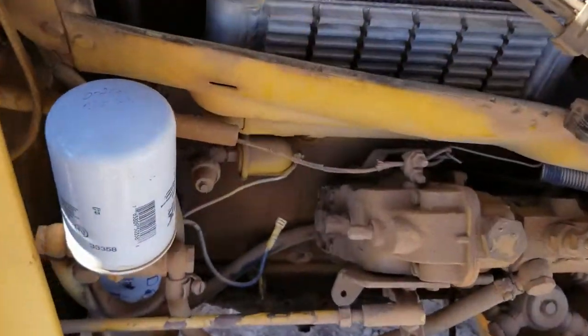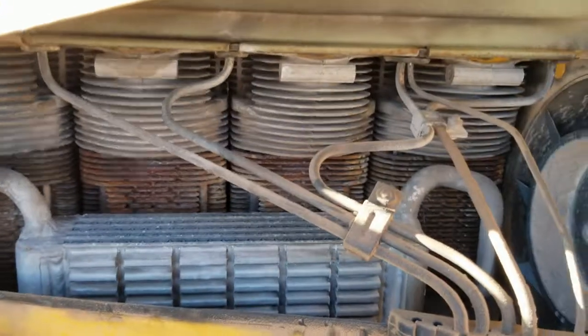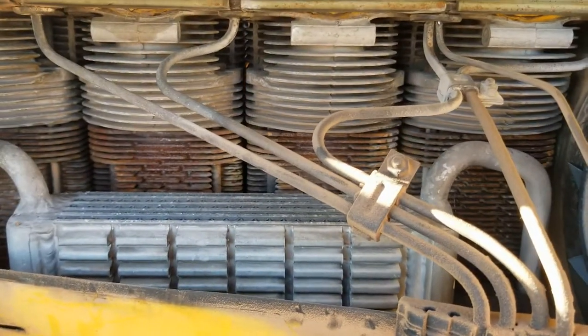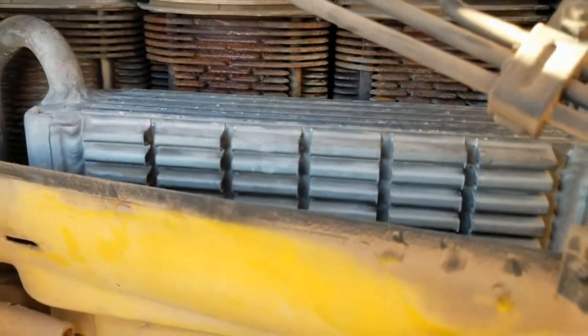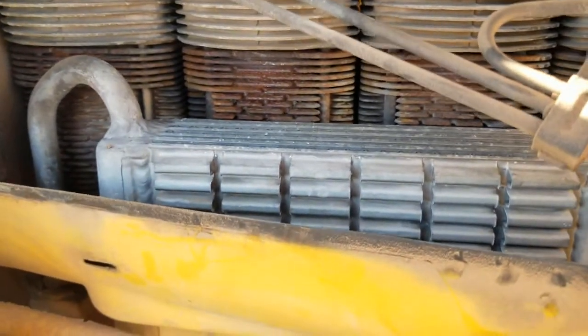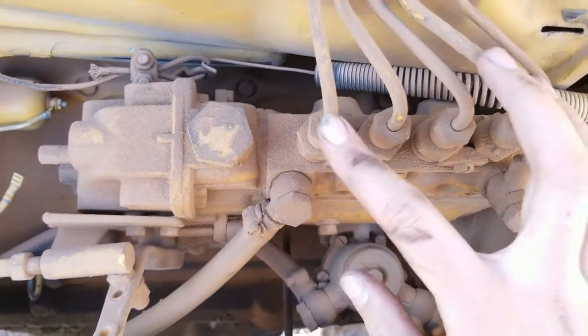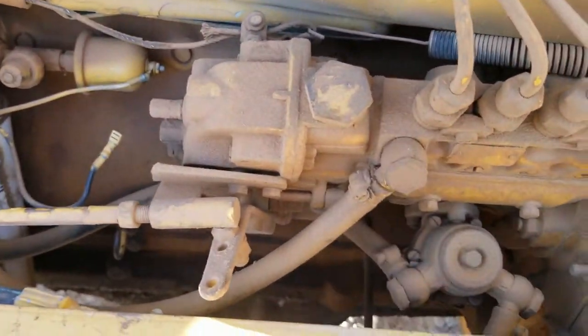And inside this blower duct, the first thing you see is the oil cooler, then you see the fins on the cylinder jugs. So again, there's no conventional radiator, even though you could call that an oil radiator if you wanted. It wouldn't really be wrong. You see the injector, high pressure fuel lines running through that, and then to the back there are the transmission and hydraulic oil coolers, which are pretty essential. The transmission in particular, this machine's hydraulic system shouldn't get that warm. There's 3 cylinders, and the duty cycle on most of them is pretty limited.